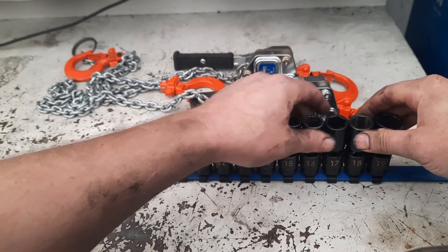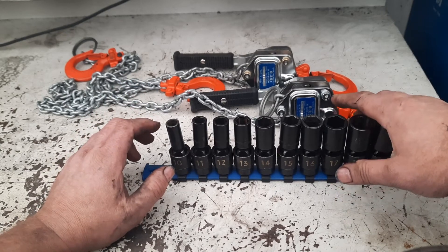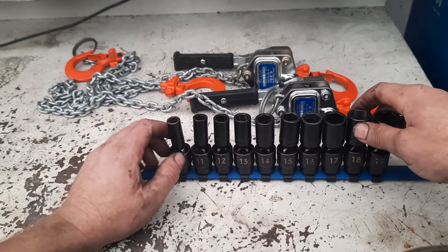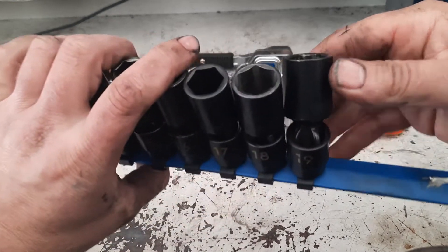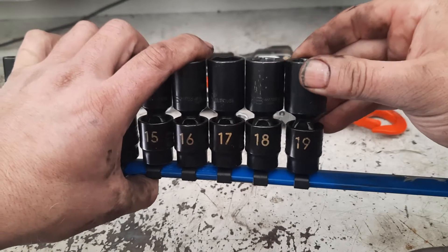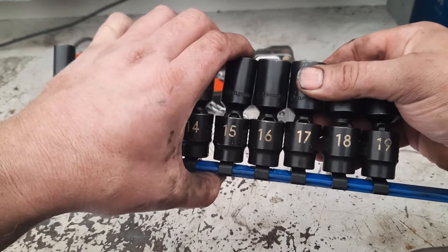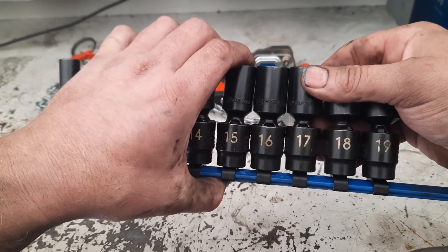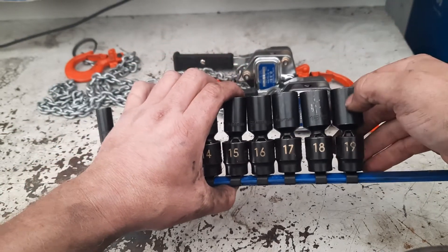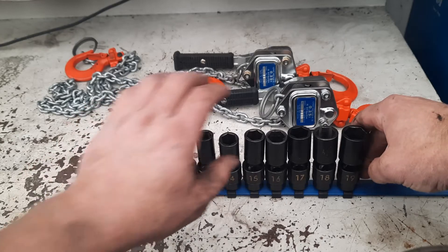$145 wasn't a horrible price but that is pretty pricey for where I want to be on wobblies. Being it was a full set, and I only have a couple of deep wells in metric — I think 13 to 15 — which actually happen to be Matcos also that I picked up individually. The pinless design has more wobble than the pin design, but I haven't had any failures with mine. I've been running a 15/16th one for some time on a 3/8 drive and haven't had a failure.